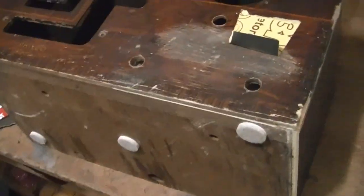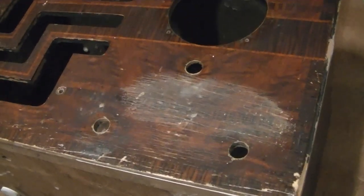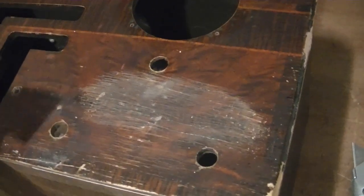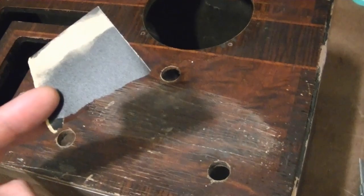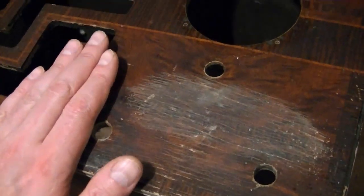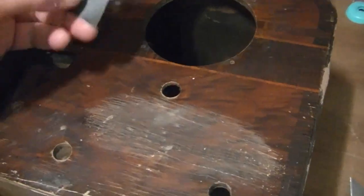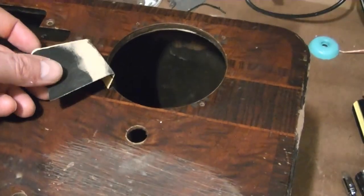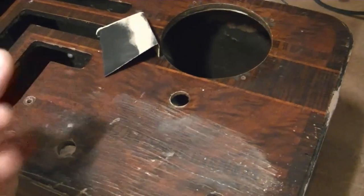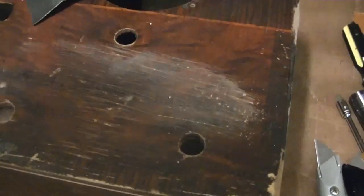Now for the task I've really been dreading on this cabinet — trying to clean up the front. First thing I did was wipe it down with some mineral spirits just to clean it off. It may seem crazy, but I'm actually sanding it down with 600 grit sandpaper. This is a photo finish, so you can't strip it or you'll take it right off. But there is a bit of a clear coat of lacquer over the photo finish, so you can sand it. It looks a bit yellowy-brownish, but I think the lacquer has yellowed over the years, plus there's probably some old wax and oils that the mineral spirits didn't clean off.